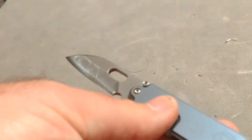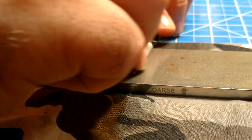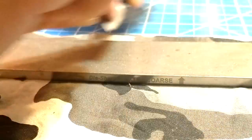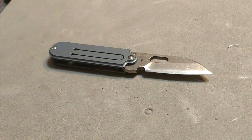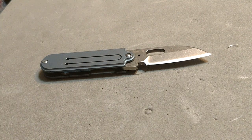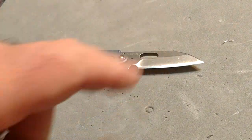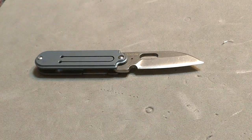You can see all the scratches from where I got to grinding and took the bevel back quite a bit. I spent about two hours reprofiling this knife with an extra coarse diamond stone. I can say firsthand this is a very hard stainless steel. It may not be as tough as S35VN but it's way tougher than 8Cr13, 440C, AUS-8 — all those steels. Don't let the price fool you or the trolls who say it's probably just pot metal.